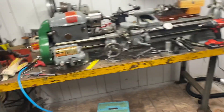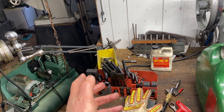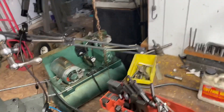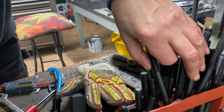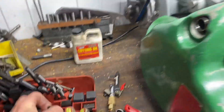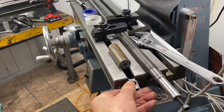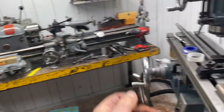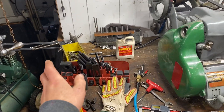What I discovered yesterday that really bummed me out — this strapping kit I got off Amazon has just been an absolute turd. It's like a perpetual burr, it's awful. Look at what they came up with to hold this stuff — there isn't even a second hole; they couldn't put a second hole for these things to slide down into, so every time you pick it up they just fall out. Total turd. The T-nuts are the correct size for this mill, but the T-nuts don't fit. This is a metric machine and this is a metric kit — this should fit. I'm probably about five thou big, so I'll be shaving all of those down.